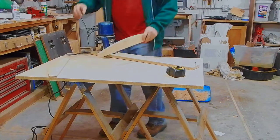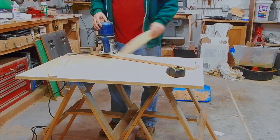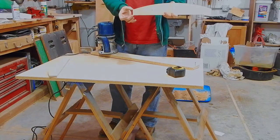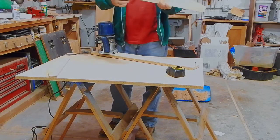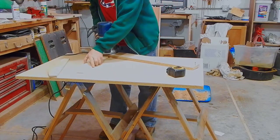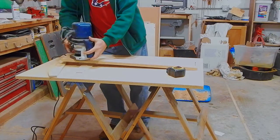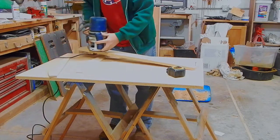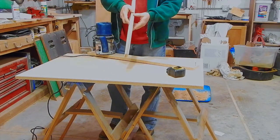I found the center point, which is 68.4 centimeters — the furthest point from the pivot point to my router bit. I wanted a little bit of a relief here; we'll see later on why I want to do that rather than just cutting it straight across the arc. I used double-sided tape, placed it down, and ran the router swiveling on the pivot point to get the arc I wanted. I eventually stepped it up to a half-inch piece of plywood.